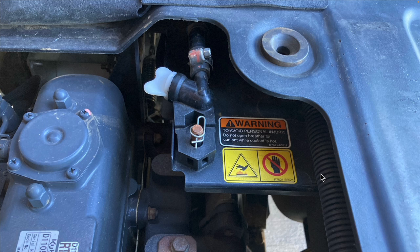When the coolant is draining, the breather allows air to easily enter the system. Conversely, when the coolant is being added back into the radiator, the breather allows air to escape. In this way, the breather helps to prevent the formation of any trapped air pockets.